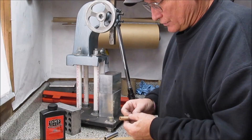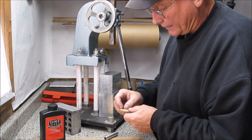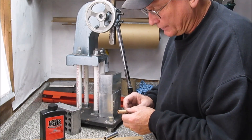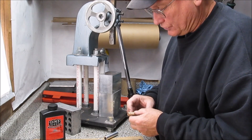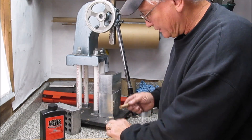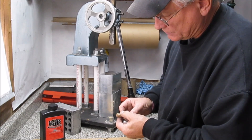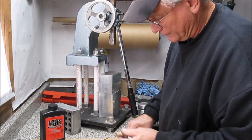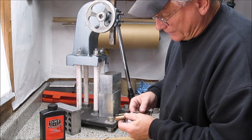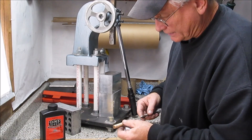I'm going to press a number one-and-a-half, which is three-eighths inch of actual timer powder. That'll have another quarter inch that has a core going into it in the middle of the powder grain, so I actually want to press two-and-a-half — which is five-eighths inch of powder. I've made a mark on here at the three-eighths that I want the actual timing to go to the one-and-a-half. And I've set a pin vise with a one-eighth inch bit to go just that deep when it goes in as far as it can.